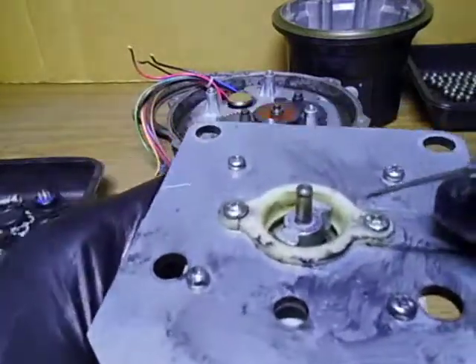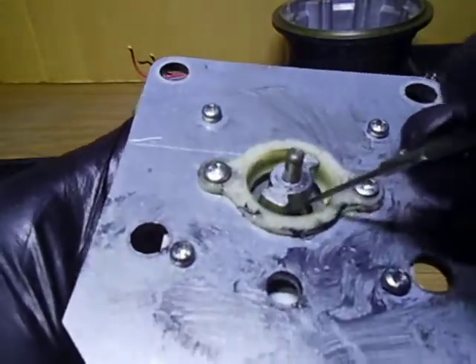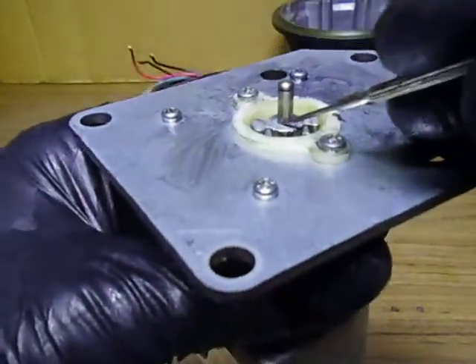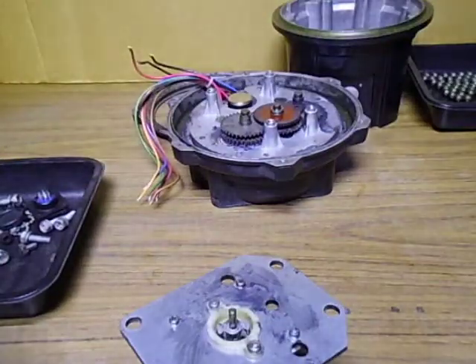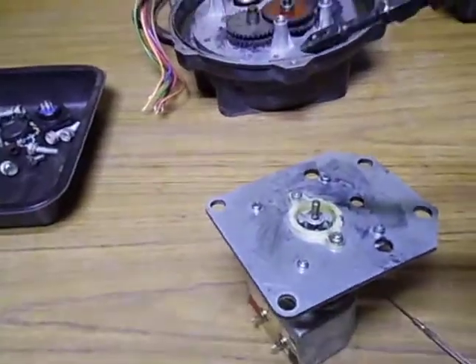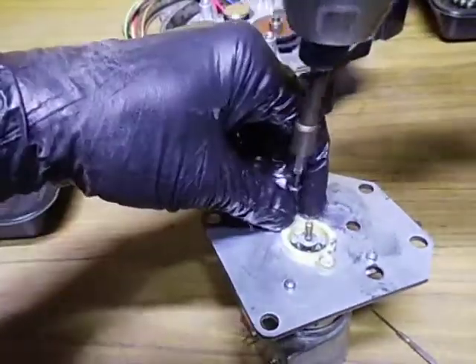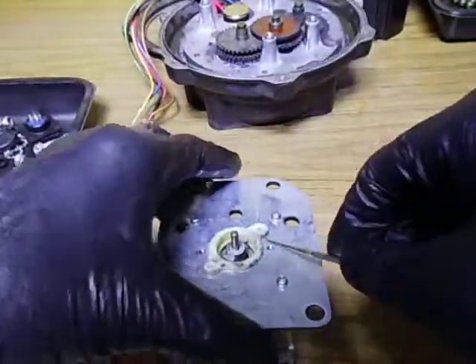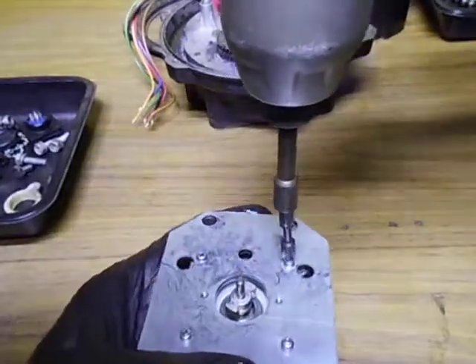This is the suspect item - the VK rotor, or VK butterfly. As I suspected, it is loose - it's flopping backwards and forwards, which means the grub screw is loose. You can actually see the top of the cutaway there - we put the screwdriver in and that's the top moving up and down. Let's get the VK drum out of the road - it's coming out. I need a bit of a clean up here, it's got grease everywhere.